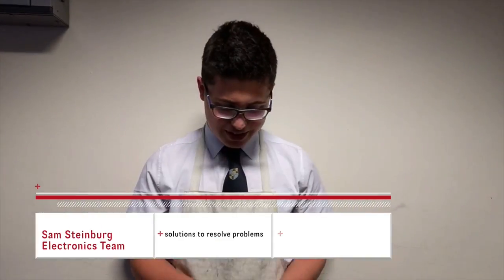The main issue you have with building electronics for a space balloon is you've got to have minimal weight and also protection against cold, humidity potentially, and low pressure. One of the ways we've addressed this is we're using this camera which is waterproof in itself, so we don't need to spend too much weight trying to waterproof all of the other components, and it can also survive the drop that it'll need to. The GPS system is harder — it has to be very well insulated and protected against all the extremes it's going to come in contact with.